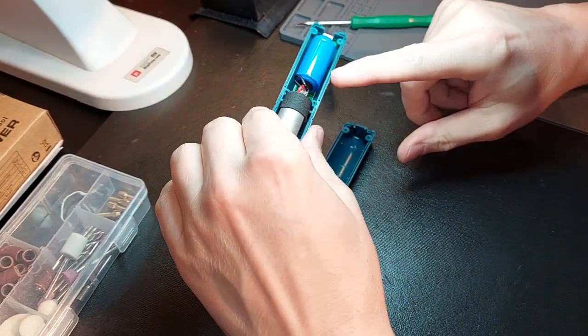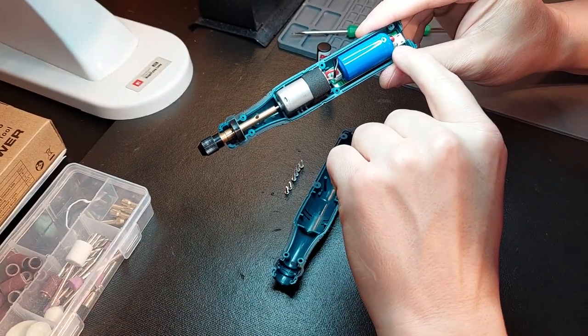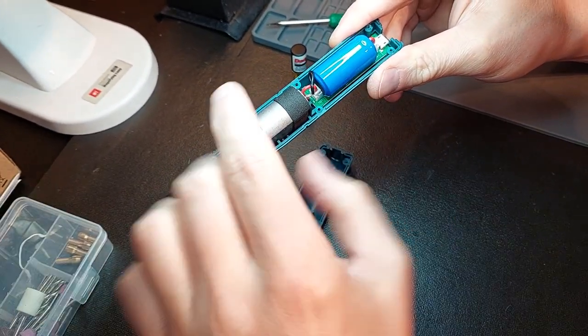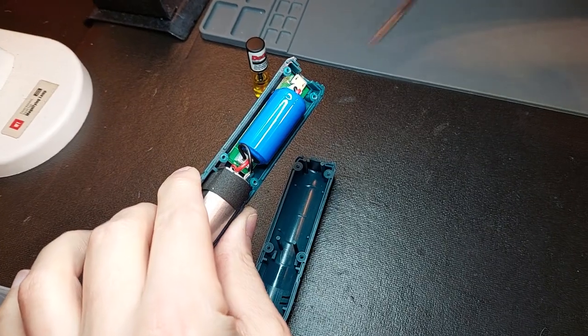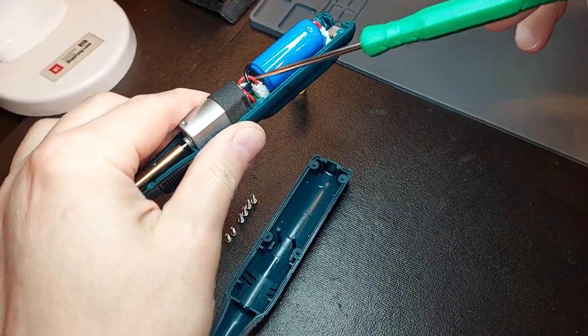And you can see here the lithium ion cell, beautifully packaged. Everything here is nice and neat. We've got plug connections in case the unit had to be serviced. If you ever had to change the lithium ion battery, you could do that. You could see right here the circuit board. We could see the battery connector, USB connector. And you could see once again, I hope she can see that, those solder points.